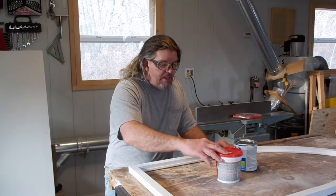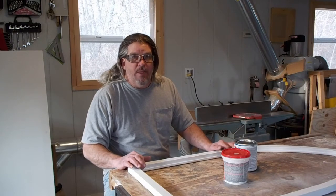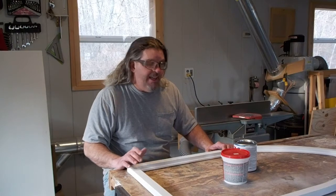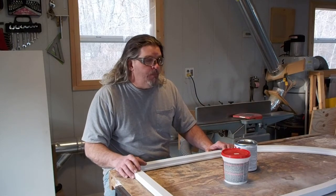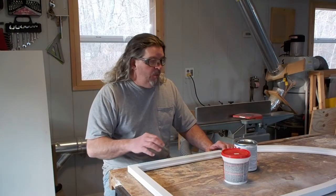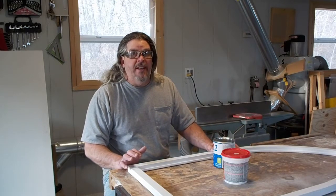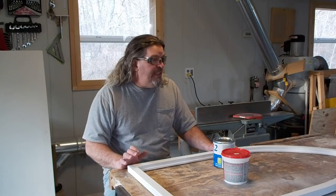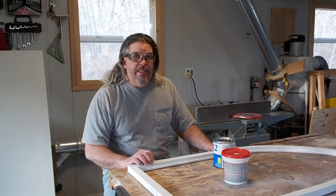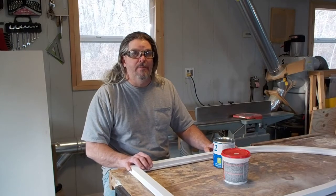And then the glazing is for the stained glass once it gets installed. That's what I'm going to do now. And then I'll seal it into the wooden window frame with the glazing. I'll let that dry for probably 2 or 3 days just so that it stiffens up a little bit. Then you can brush it with the oil-based primer, and that's when the clock will start on the 10 days. So it'll probably take 2 weeks from right now to be able to put the finished paint on the completed window sash. And then after that, I can paint it with the latex paint, wait 3 days, and we can put it in the building.